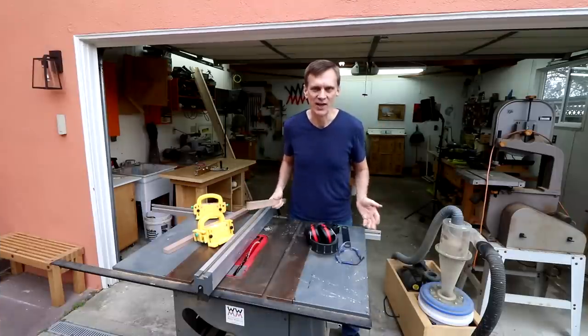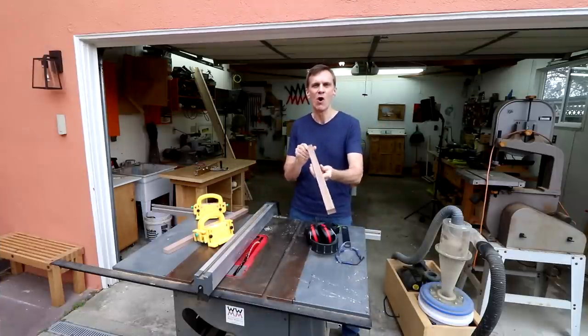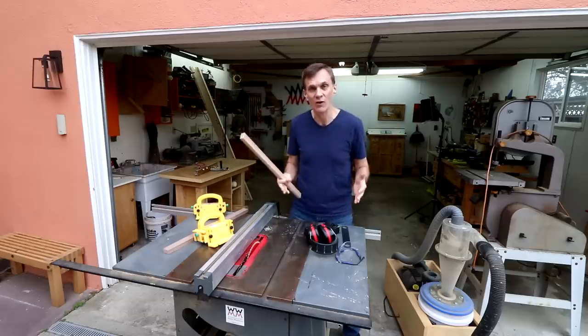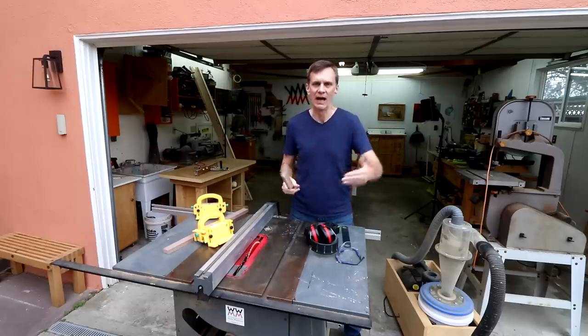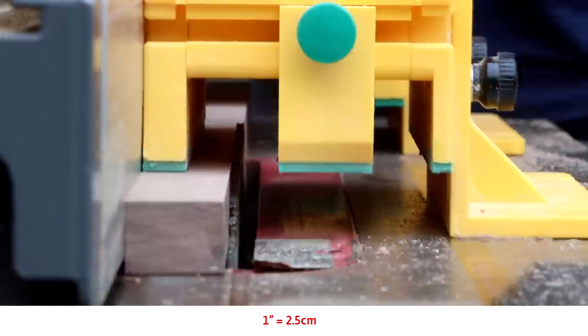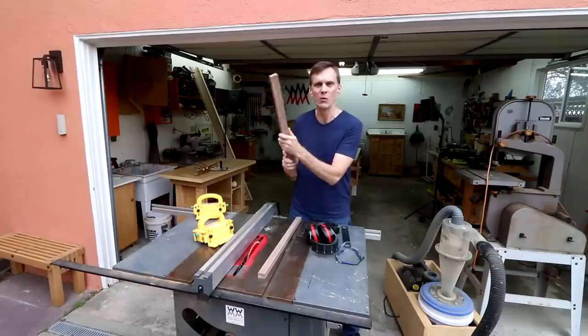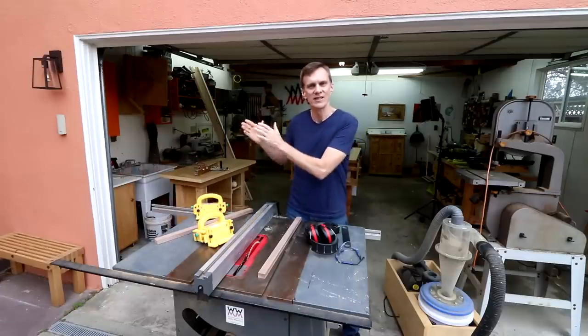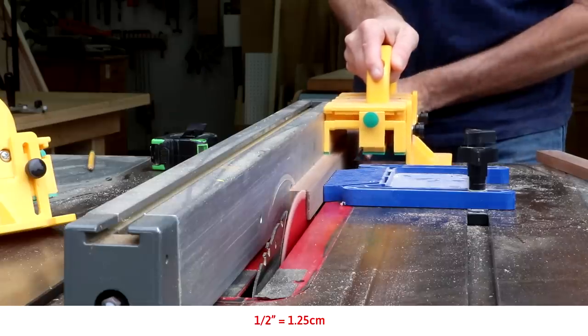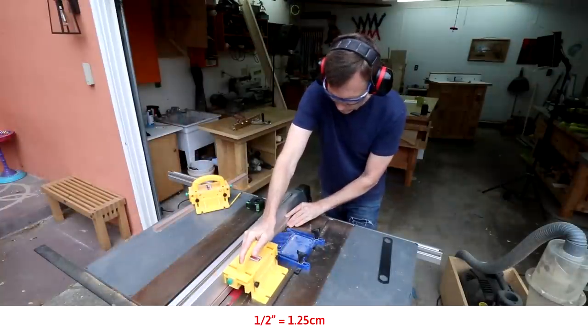This project is really an exercise in working on very small pieces of wood, and as the projects get smaller the accuracy they demand gets higher. So I'm going to start by ripping this board down to an inch wide. I'm also going to rip a second one to use as not just a tester but a backup in case I screw something up. I'll resaw this to a half inch thick so that the box isn't so bulky.